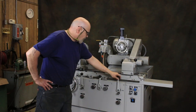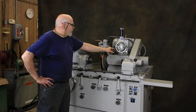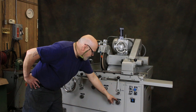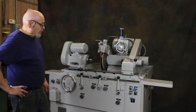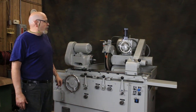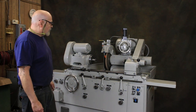Right now if we work this lever we're going to go through an automatic plunge cycle where you see it feeding down. I like to adjust that feed rate with that knob there, and when we get to zero we begin a spark out period and the handwheel retracts and the head goes off. And you stop your workhead.